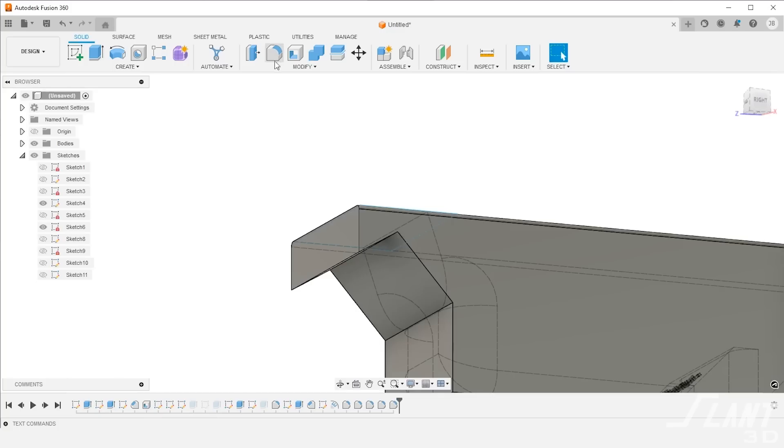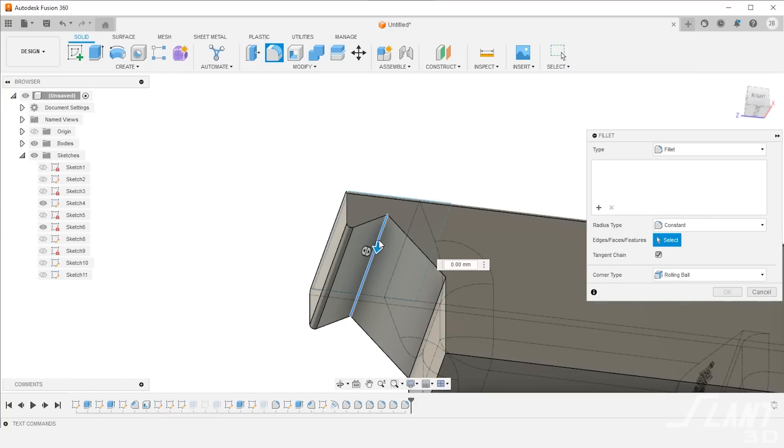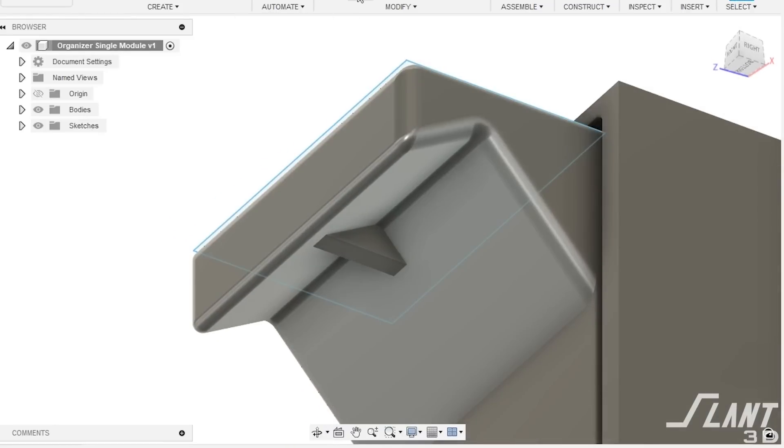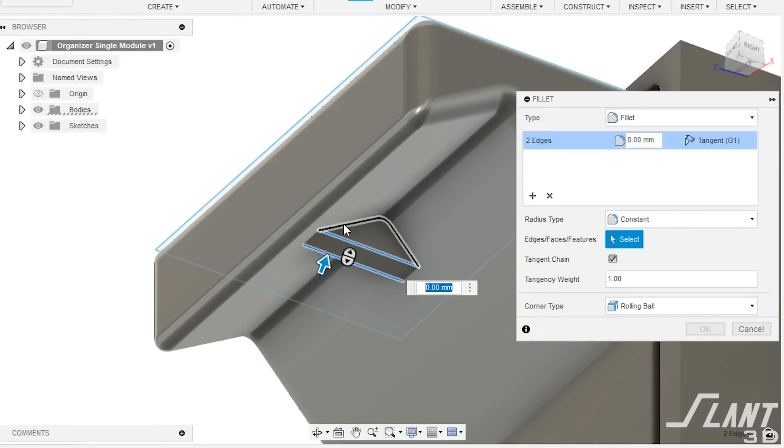The entire assembly prints completely as one unit and comes off the machine fully complete with drawer and outer housing. This is ideal for a print-on-demand situation — all parts for the assembly are done in one print, which is what you want if you can do it cleanly. The front handle of the drawer is angled so there are no direct overhangs but you still have a good place to grab. Because layer lines run in that direction, an outer lip could potentially snap off with a brittle material like PLA, so we added a small rib in the middle for rigidity without affecting grip.